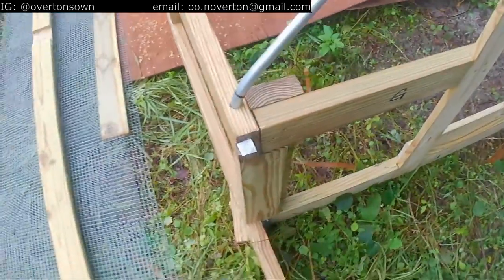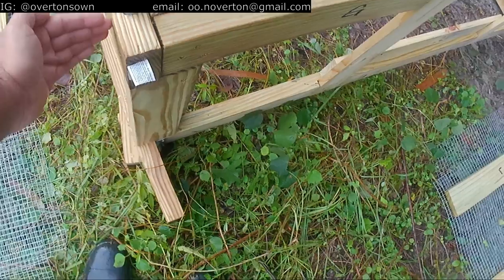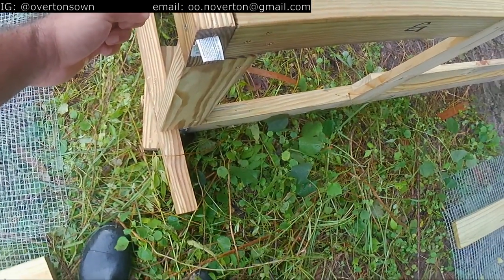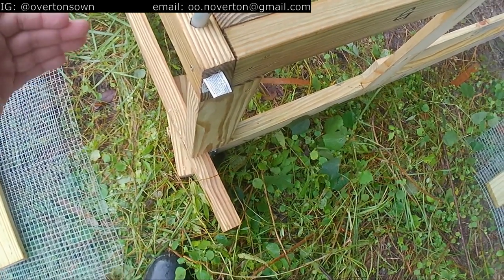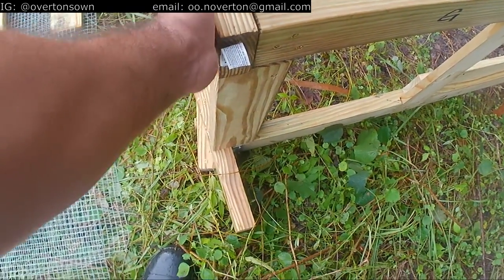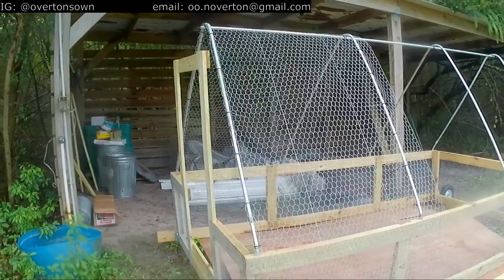Right here on the corners, this 2x4 on each corner is actually an extra piece. What it does is square off the sides, so I won't have to bend or wrap the hardware cloth around the corners. I just cut the side panel to length and then I'll be able to staple all the way up to the edge. The other thing is I took a paddle bit and drilled into the 2x4 — the original design suggests mounting the conduit to the outside of the 2x4 and fastening it with two screws. Instead, you take a paddle bit and fit the conduit down into the 2x4.